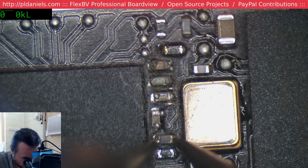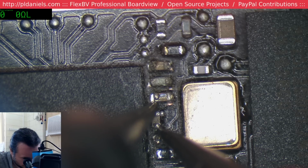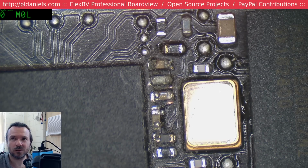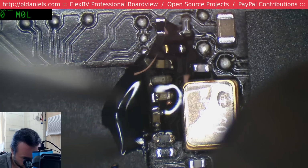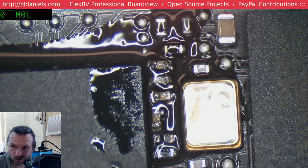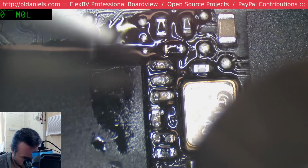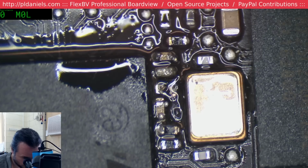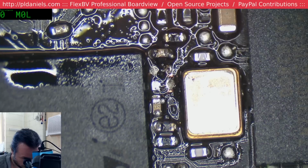Yeah, you're a dead short there, buddy. Actually, everything should be a dead short because that's why solder is squeezing out of it. Except that's not. Huh. Yeah, it really is more a case of, for interest's sake. Now the big problem is going to be, this is an underfilled chip, which means these could well pop out. Pop some balls out without us intending to. I'm going to drop down to iPhone level and just do some brutality here. Oh, no, we've screwed it.